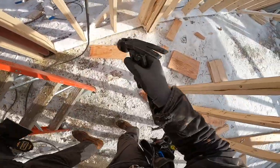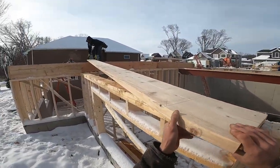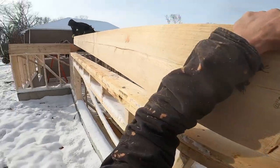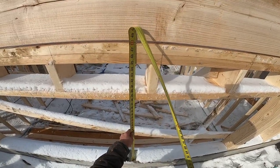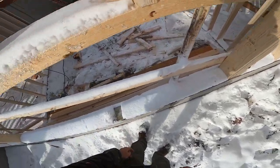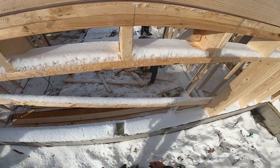Alright. My turn on the next one. You're gonna hand me the column. Yeah, I could cut it up here too. Oh, this is the one we got a double, right? Yeah. 37 and a quarter. 38 and an eighth. Might cut me a 2x6 of 38 and an eighth real quick. 2x6 for what? Or 2x4, whatever. Just a post? Yeah, middle. It's got a real bad bow to it. What's your number? 38 and an eighth.